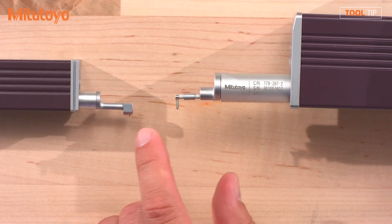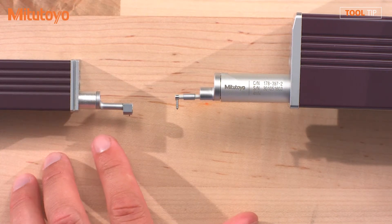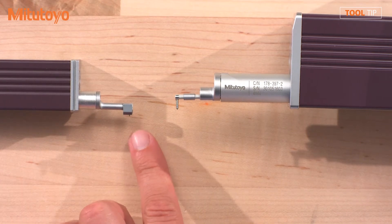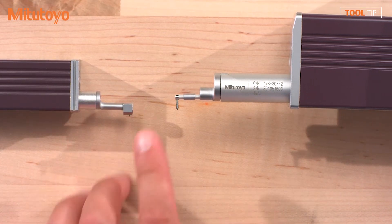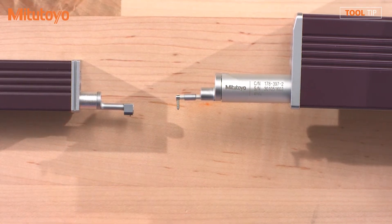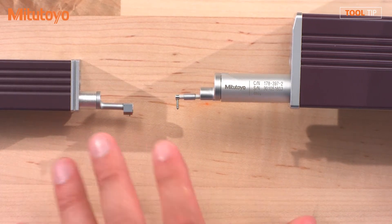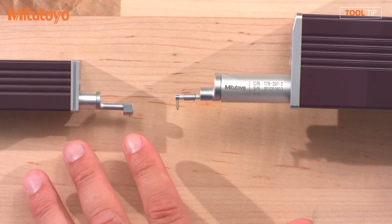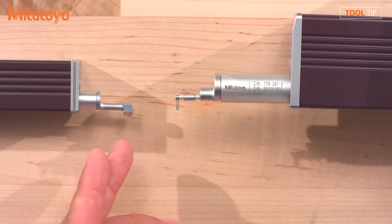This is a skidless system, as I mentioned. The skidded system is very similar, except the stylus and the detector are all one piece. I still have the stylus protruding out from the detector, but around it is a housing, and that housing is what we refer to as the skid. The skid is going to act as a mechanical datum for the surface you're measuring. On a skidless system, that datum is actually inside the drive unit. Most entry-level systems are going to be the skidded unit with the housing around the stylus.